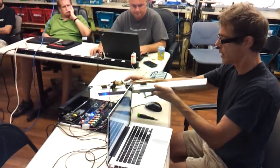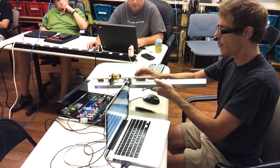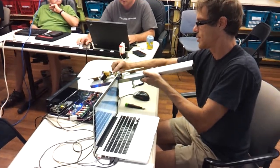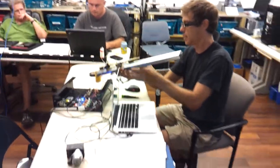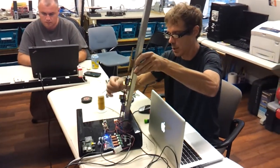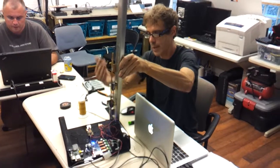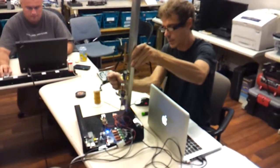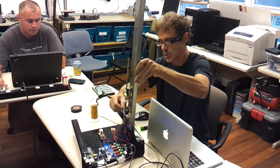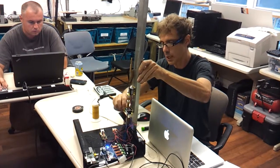This pulley right here, I cut on the metal lathe, and what makes it slide, because it has to slide back and forth. So this has to rotate. It has to make the thing rotate on this motor, but this goes up and down, so this has to pass through here. So it has to be able to turn it like that without offering any vertical resistance. So this is a spline joint. It's a four-face spline,